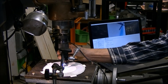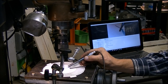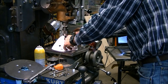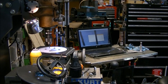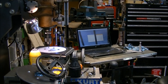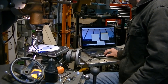Now I needed to set up the USB microscope. I'm using it here to locate the paper template that I'm going to use — there's a link to the calculator in the description below that you can use to produce those paper templates. Once I got it centered, I went ahead and stuck it down with some spray adhesive, and that template will be my guide for drilling the indexing holes. On my first attempt, I put the microscope on the opposite side of the plate from the drill to keep it out of the way, but for some reason I still don't understand, when I got halfway around I was halfway off on my hole spacing, so I had to start over.